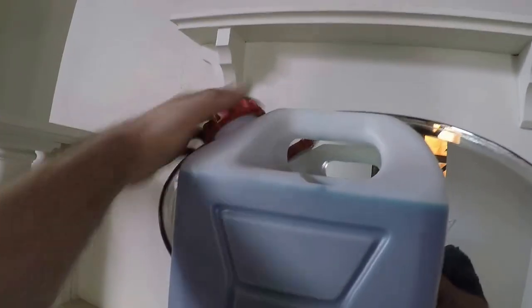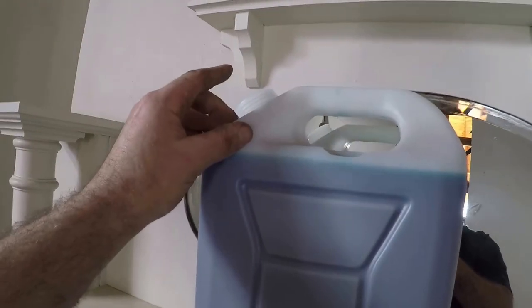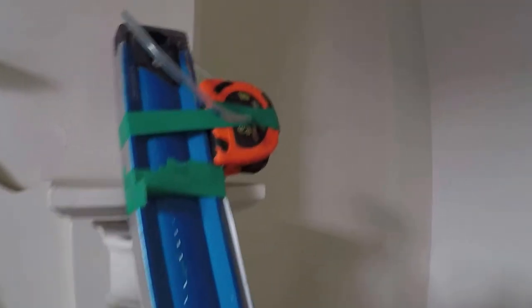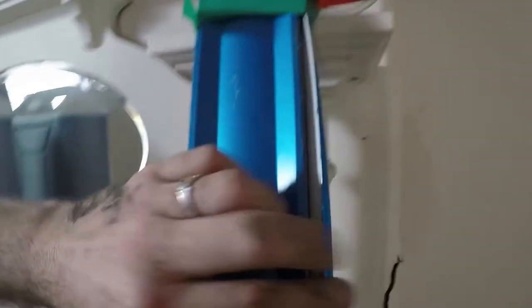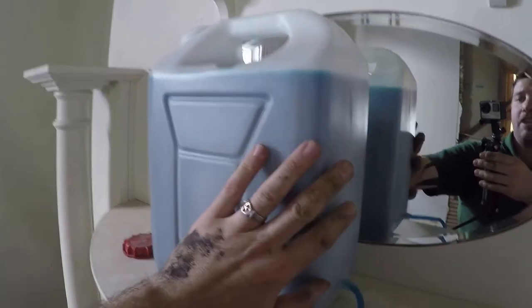So I can take the lid off here so the water can move freely. Otherwise what happens is the same thing as if you had your finger over the end of a straw — the water doesn't move up or down the straw. So what you want to do is allow this to breathe, and then you'll have a look at the end of our water level here. This is the hose and it's open, and on the front of our level itself we've got water that comes up to there. That's why we've got blue — you can color this any color you want, red, green; blue works well for us.